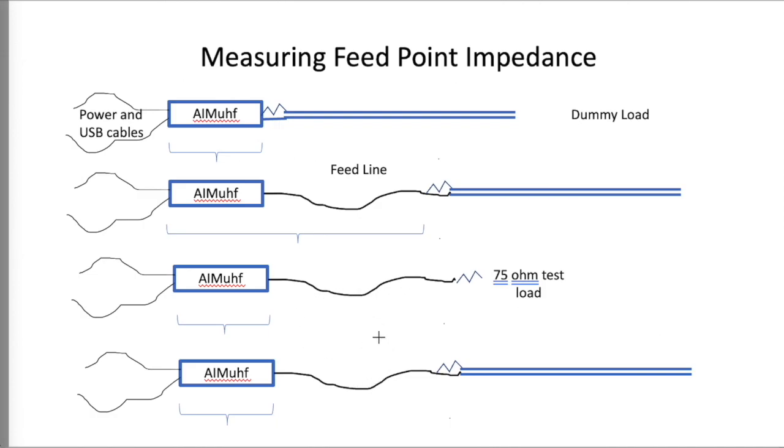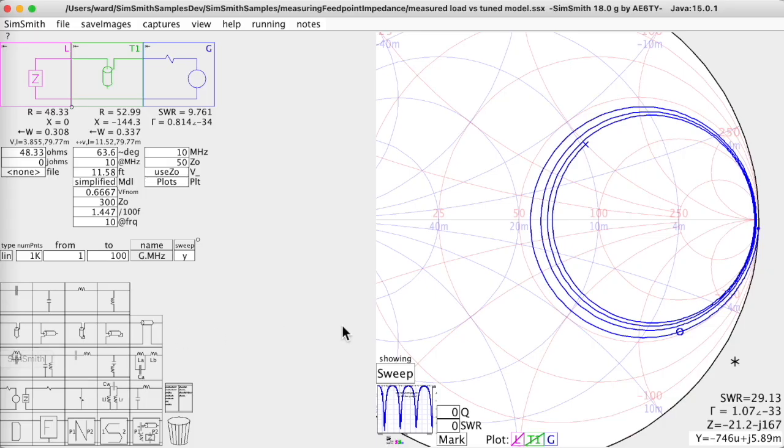Let's take a look at my dummy load first. Here's the schematic: it's a resistor with a 300 ohm stub transmission line. This transmission line is lossy — it's 300 ohm twin lead, it's cheap, and it's also laying on the shelf in my shack, which adds extra loss. In first glance it's actually very much like an antenna; usually the antenna has some capacitance which brings this whole circuit down this arc, but it's a reasonable approximation and gives me many of the properties of a real antenna.